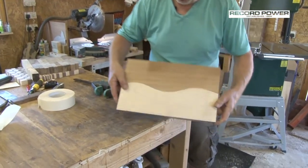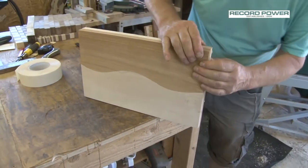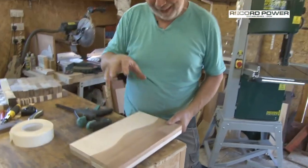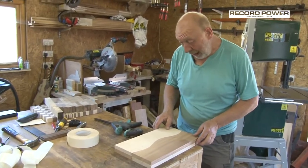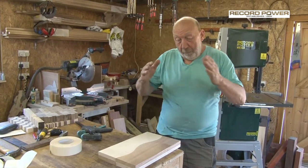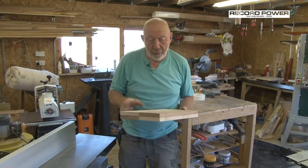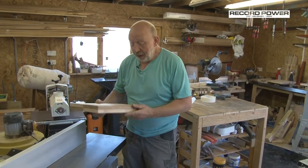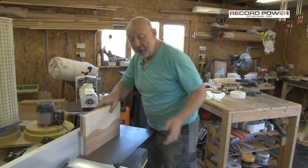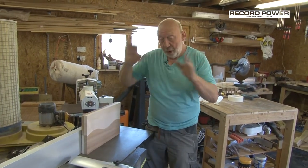There you've got a board all stuck together — you know exactly what the crack is and you can cut and rejoin it on the bandsaw. What I'm going to do first is just run it over the planer to make sure the edges are perfect, so when I take it apart there'll be no problems joining it back together. Swapping the timbers over, I know everything's going to fit perfectly. I'll plane it up both sides and get a smart edge so the whole thing is square.